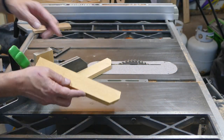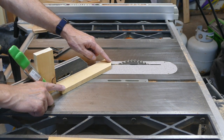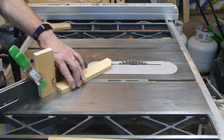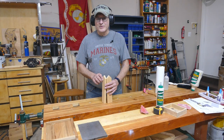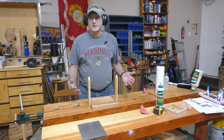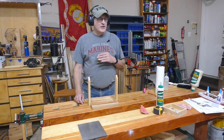So let's move on to the second half of this project. The next step is to dog ear the sides — I've already split these into two inch wide pieces, and I did have to use a different picket since I kind of ran out. I'm using this 45-degree dog ear already, so I'm just going to cut the other side 45 degrees as well, on both pieces. I set up a stop block just to give me the actual dimension. Here are the ends — the ends are completely cut, you can see the 45s on top. I'll glue and nail these to the ends and then put the top pieces on. Great project for kids — if you're going to do it with kids, pre-drill for the nails, give them small brads like one inch brads, and let them nail it together. They'll have a great time.